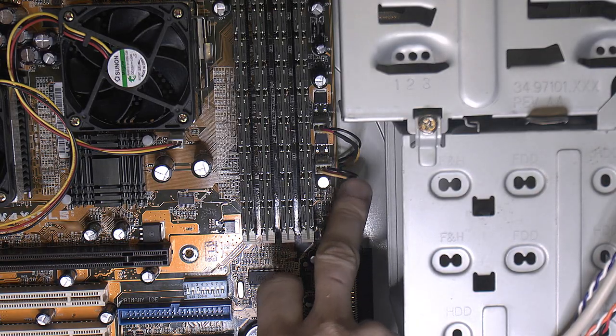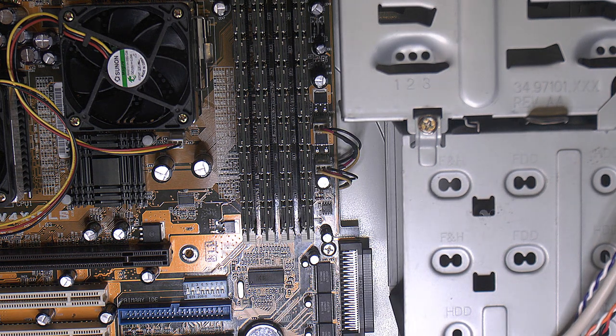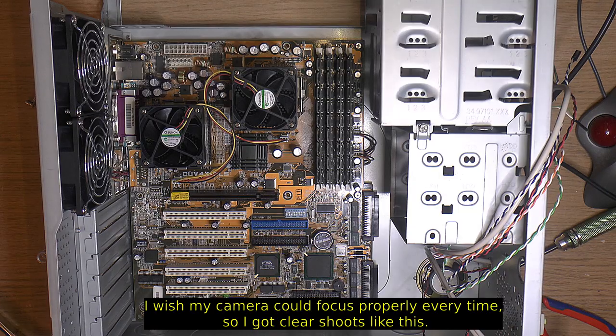That's what we worked for to get that nice and done. I got 6.1 volts to the fans, should give about 1000 RPM each. Combined with the power supply, we should have more than enough ventilation, I think, for these CPUs.